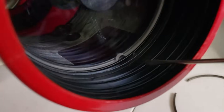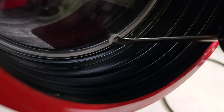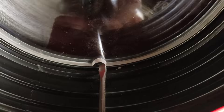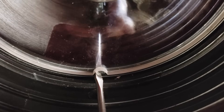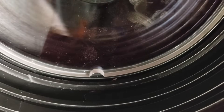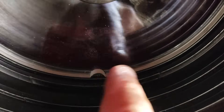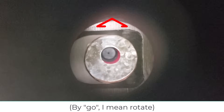So I put the glass back in. I mentioned this notch earlier — it's the one they use to guarantee alignment at the factory, but I also mentioned there is a little bit of slop. I can move it — it's basically plus or minus about a degree. I'm very curious to see if that's enough to fix the side-to-side collimation. Let's take a look at the collimation while I slide this back and forth. It needs to go to the side — that's the first adjustment we have to do. I'm going to use that little notch movement and see if it's enough to fix it.